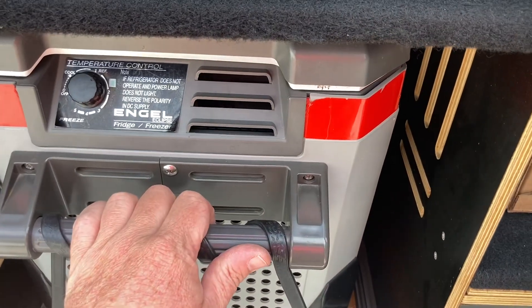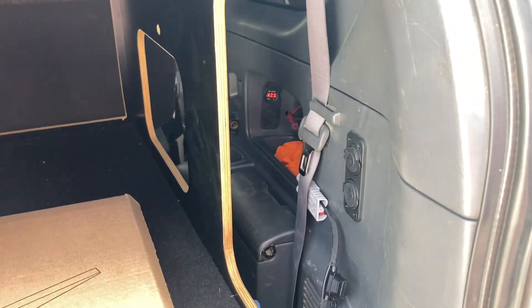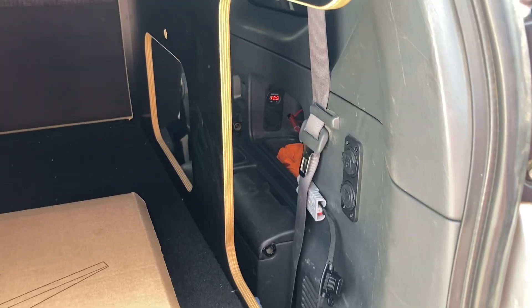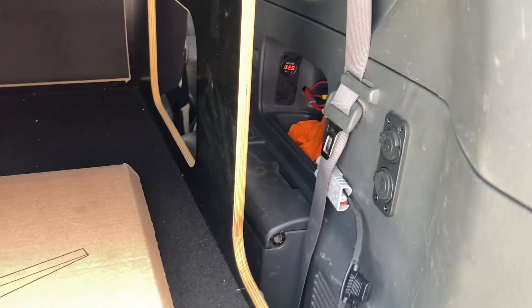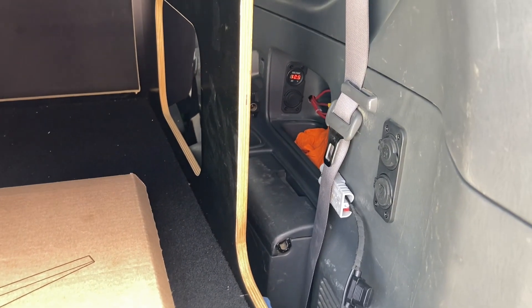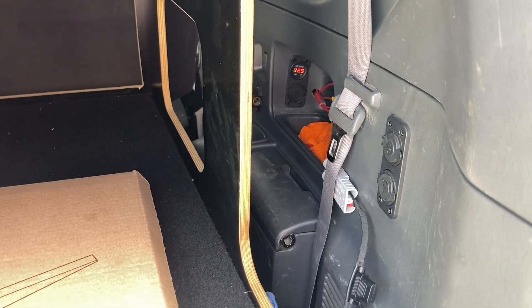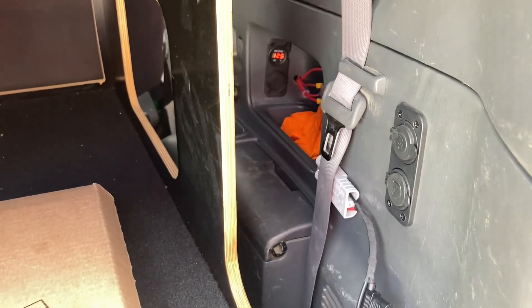The fridge is not running at the moment. When the fridge cut in, this would drop a bit lower than that. But with both running — the fridge and the Starlink — the battery voltage at this end dropped to 12.3 something. But that's not what matters. What matters is the average was 2.2 amps. The maximum we saw was about 3 amps. 2.2 was about average, and the lowest was about 1.8 to 1.9. So the minimum was just under 2 amps, maximum about 3.